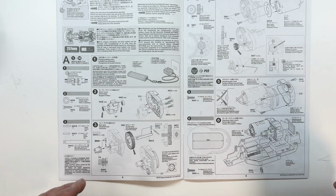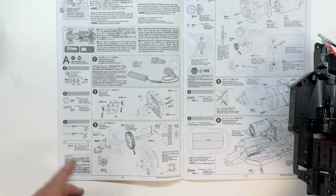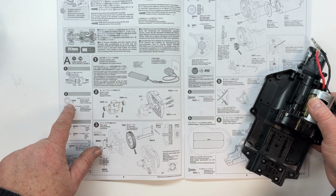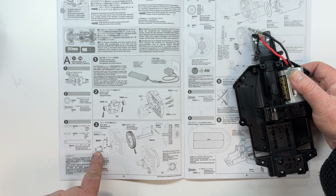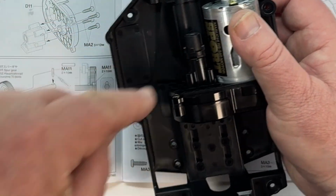Okay, so about 15 minutes have gone past, and you can see here this is where I've got to. So drop these bearings in. I've actually put roller bearings in the kit. This came with plastic bearings. I've put roller bearings in there and mounted this onto this back plate here. You can see here the drive shaft, this cup sitting inside here with a pin through the shaft.